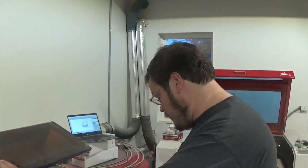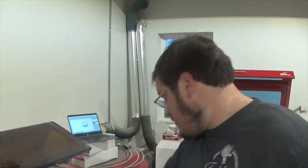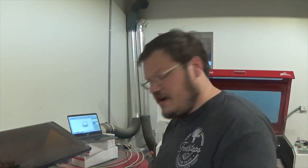I'm going to run this. I've never cut this particular foam rubber — it's got a weird netting on the back, so I hope this goes smoothly. I'm cutting at 35 millimeters a second, 70 percent power. Actually, I'm going to try to keep my machines at 65 percent power or lower, because that saves life on your tube.